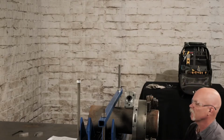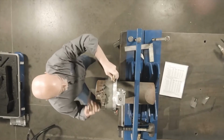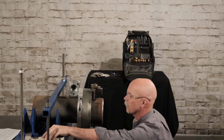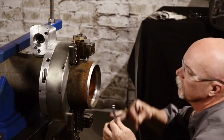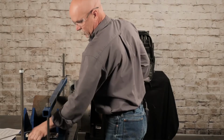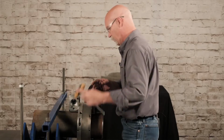Next would be center. Just picking a spot to measure at. 2 3/16. To center it with fully adjustable pads, you got to tighten the one side and loosen the other, shifting the center of the machine. If you want to be more accurate with your centering, you can use a more precise scale. And now we're centered. But we always go back and check the square, so it's square, center, square, in case it moved when we were centering it. Still square. Still tight.